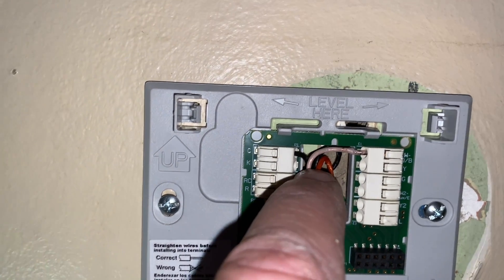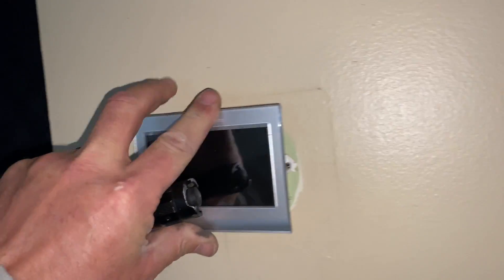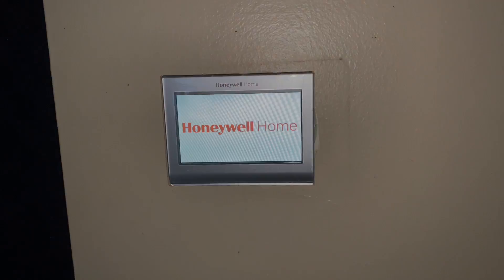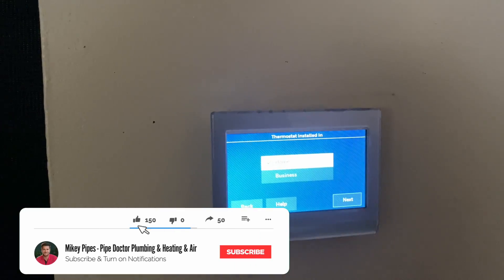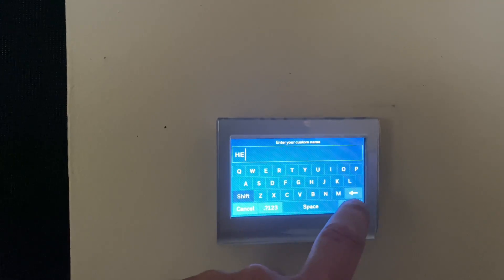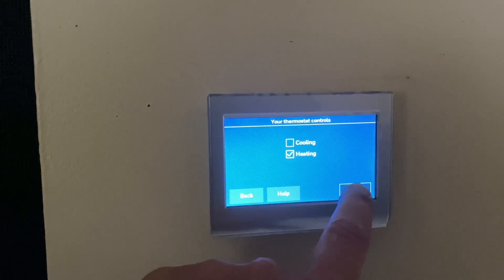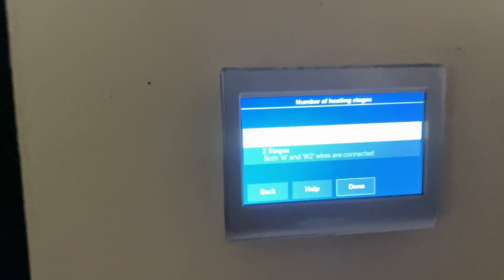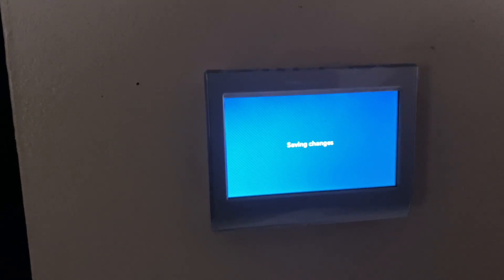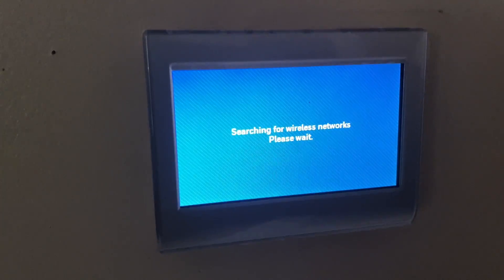My red — or RH — is going to R, the black wire which I made common is going to C, and the white wire is going to W. Bingo! English — we'll call this heat. It does heating only; we have a hot water or steam system. Hot water. We have a single stage because only W is connected, not W and W2. Saving the changes. Now connecting to Wi-Fi — searching for wireless networks.